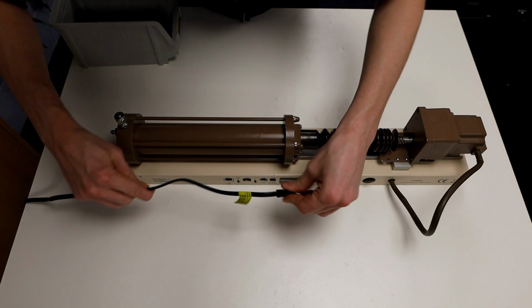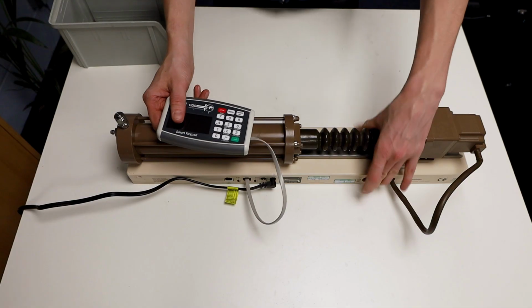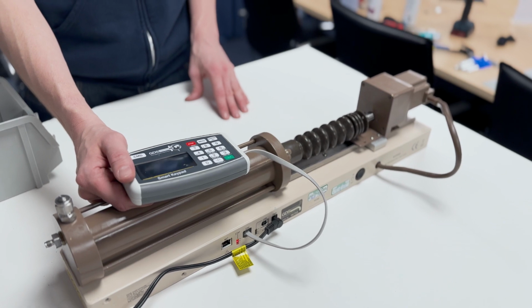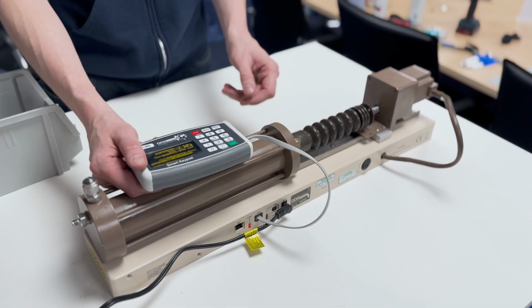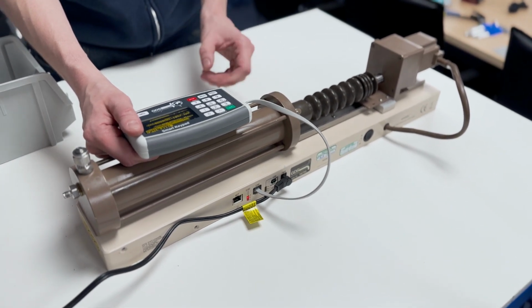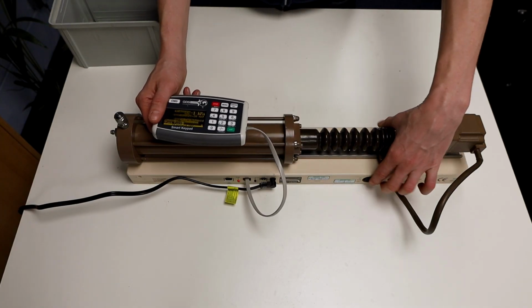Re-plug the mains power and the smart keypad into their sockets. Finally, using the smart keypad, ensure the controller works by manually emptying, filling and pressure testing the controller. You should stay close to the controller on first use to ensure the limit switches action correctly, and then that the controller can hold pressure without leaking.